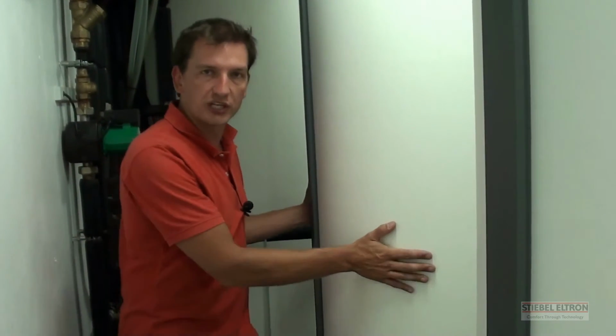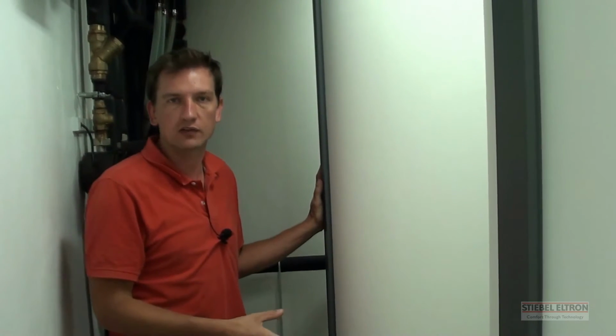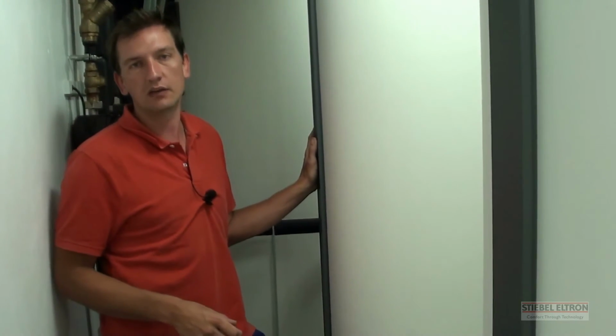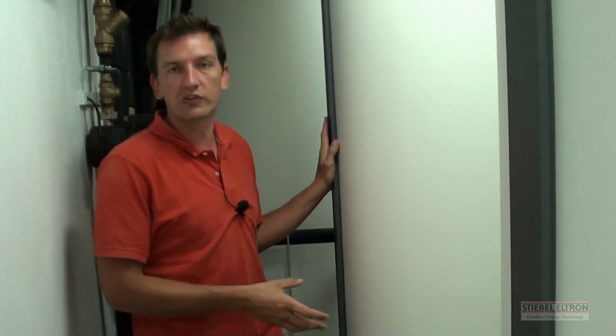The advantage of doing this, or actually using solar to contribute energy into the tank, is for in the morning when the sun comes out, the sun can't penetrate the house. So in the morning we harness the energy from the outside, from the panels, and we pump a little bit of energy to the house, which is quite efficient because you're only using a circulation pump to transfer all this energy and you're not using a heat pump.